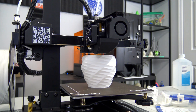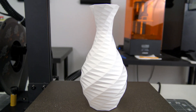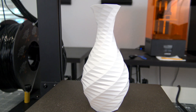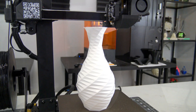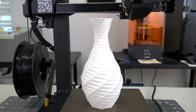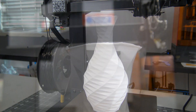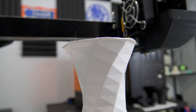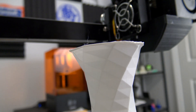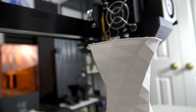The Crux 1 nailed spiral vase mode prints. Unlike some other printers I've tested, the power loss detection feature did not affect the ability to print spiral vases, and they turned out perfect. I scaled one vase up to the max 180mm tall, but found that the printer reaches its limit at about 178mm. It might be possible to adjust the bed screws and Z-axis endstop screw to get a full 180mm, but when 180mm is advertised, I'd expect the printer to ship capable of printing that.